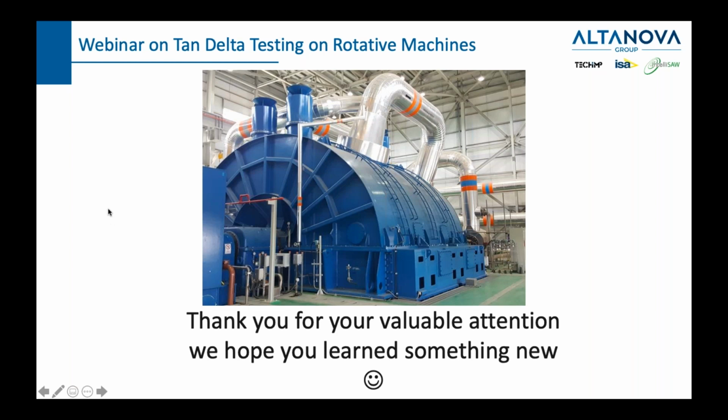Mr. Benjamin, would you ever expect tan delta measurements to decrease with an increase in voltage when testing individual bars or coils before winding? You could have something like this, but it would be due to the inaccuracies of measurement. It can change a little bit, but I did not see that with a significant increase of voltage, the tan delta decreases.